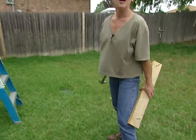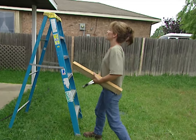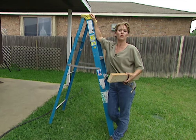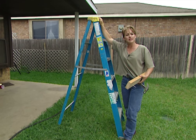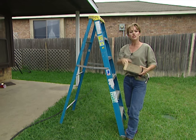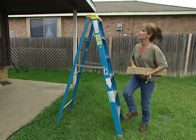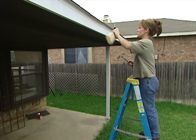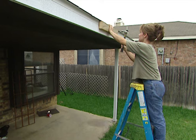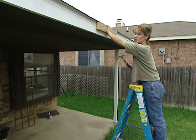Next I'm going to get up on the roof to do some more repairs. But you can see there's a pretty big gap between this top step and the roof. For safety reasons, don't ever stand on this last step — instead use an extension ladder. Let me show you something you can do so that your extension ladder is not resting on your shingles: take a 2x4 and nail this into the eave. Now your ladder will rest on this instead of the shingles.